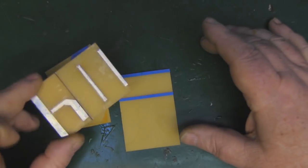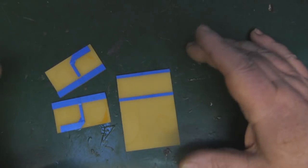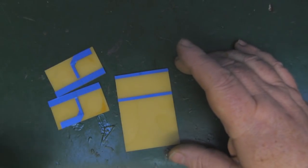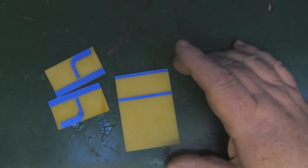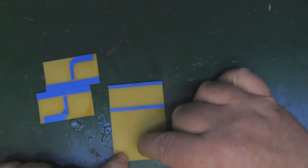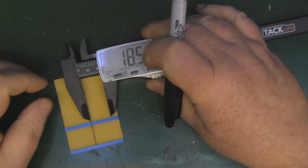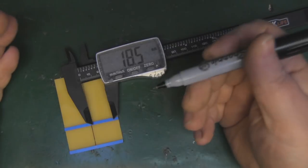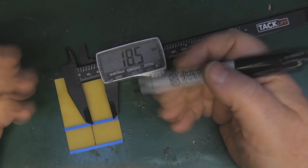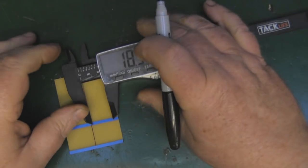Over the last few days I've made quite a few of these little Yagis but for some reason I just got ahead of myself. We're going to rectify this mistake — I was thinking about just reshooting it but it's nice to see mistakes sometimes. What we need to do first is find the center of this PCB board. I don't normally use a Sharpie for this — I'd normally use a pencil so you don't have to worry about cleaning it off before the etching tank, but pencil doesn't show up well on camera.